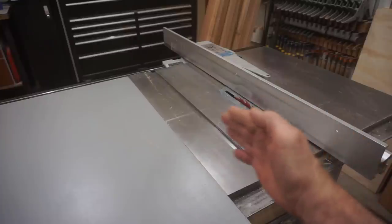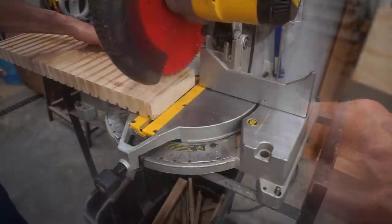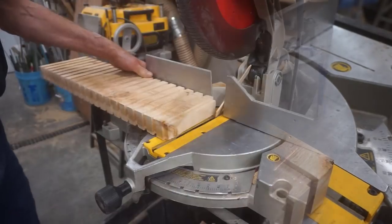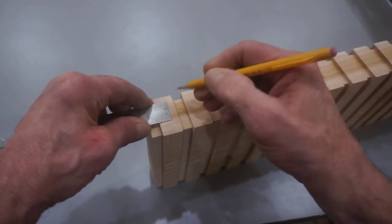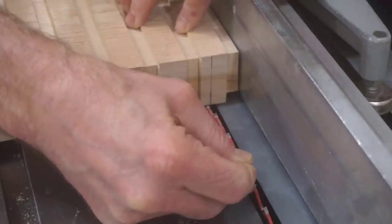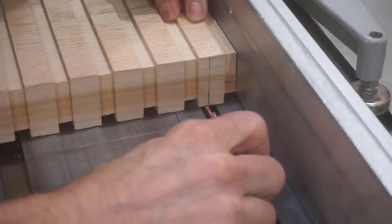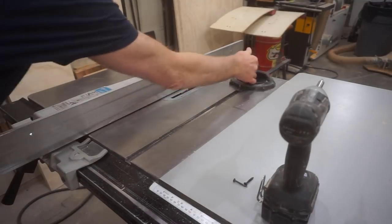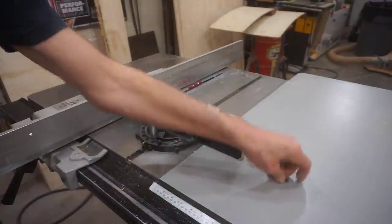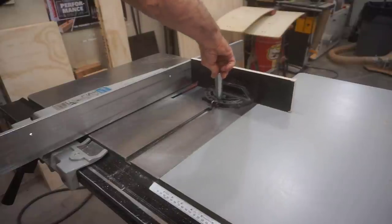The next step is to adjust the rip fence to set the shoulder height of the caps — for the aesthetics of these caps I chose a half inch. To make adjusting the fence quick, easy, and accurate I first trim off the lugs on each end of the workpiece so they're perfectly flush with the dados cut on the ends. Then I use a pencil and a rule to put a fine mark at exactly half inch over from the remaining side of the dado, and line up a sawtooth precisely at that mark right at the table saw surface. Finally I slide a miter guide into the slot and attach a sacrificial auxiliary fence — set close to the rip fence, just tall enough to support the workpiece standing on edge.